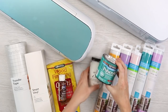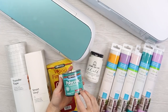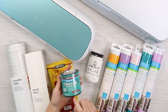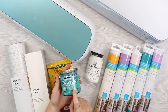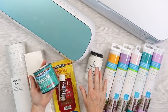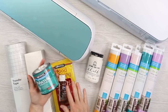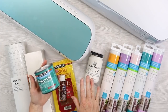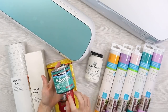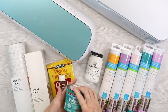We are going to seal these over the top before we put them outside. My favorite sealer is Minwax Polycrylic — this is water-based. Water-based sealer goes over water-based paint and water-based stain. If you're using oil-based on anything, you'll want to make sure to get a sealer that's also oil-based — you don't want to mix water-based with oil-based.